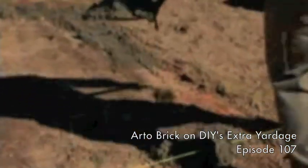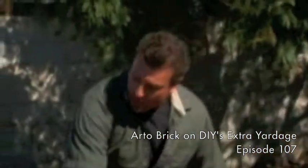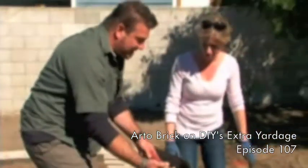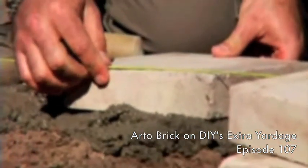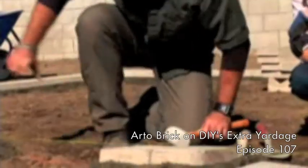All right, Jamie, it all starts with wet cement. Now this is gonna be our fireplace patio, right? We're gonna have to put a border out here so that we can work inside of that border. We take trowels like this. You're just gonna put a nice mortar bed in there. Grab one of these, and so you can get right to the line, and just tap it into the wet cement. All right, like that, all the way around this border. Sweet.